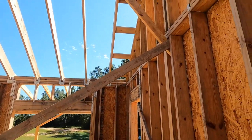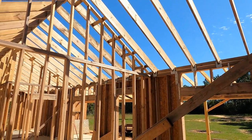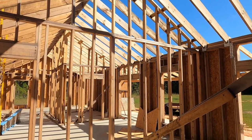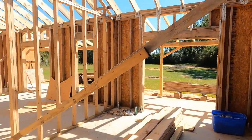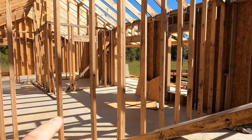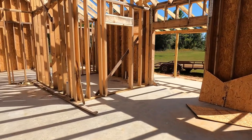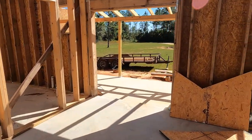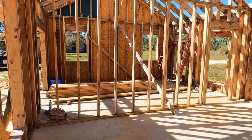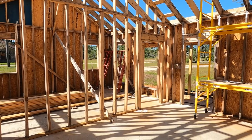You can see I've got things blocked off on the top — two by 10 rafters, two by 10 ridge — and we're going to spray foam the roof, the ceiling. I'm still deciding what I'm going to do on the walls. I'm second guessing myself — I'm thinking I might've wanted to put a two by six wall here, because when you walk out of her room and into here, it's the living room, and I should probably have put a two by six wall just to give myself a little more insulation.